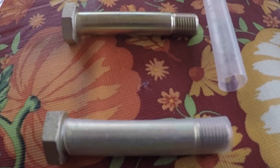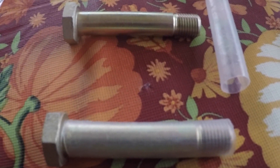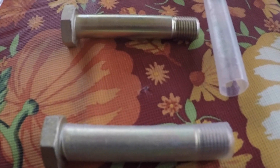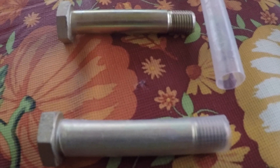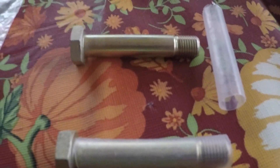We check the shank and the cad plating — that's how we inspect them. We're not really worried about the threads because the threads usually don't get worn; that's not what the close tolerance bolt does. But it's also marked a little bit differently than our other bolts.